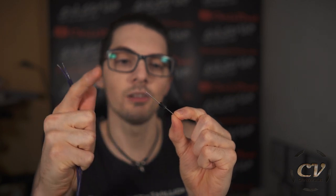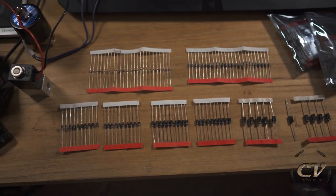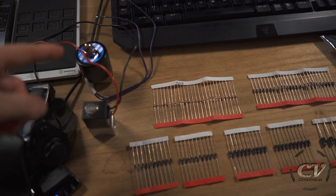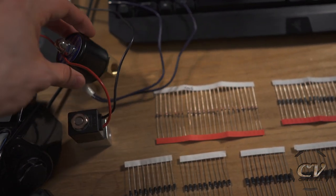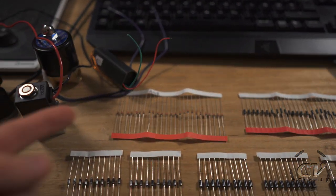That's why we need a diode — because the current can only pass in one direction. This is so genius. I bought quite a lot of diodes and waited two months for them — that's basically the reason why there wasn't any flame fist progress. These are two solenoid valves right here. What I noticed is that a small one obviously has smaller coils and the spark isn't as formidable as the spark of a big one. And this thing right here is a high voltage module.